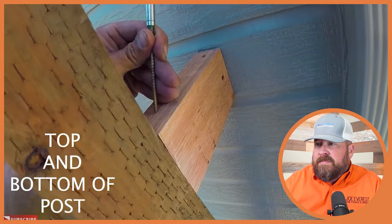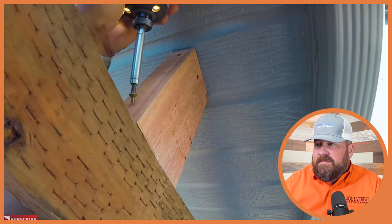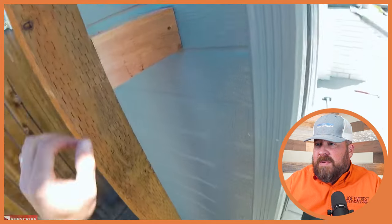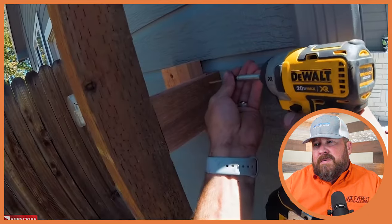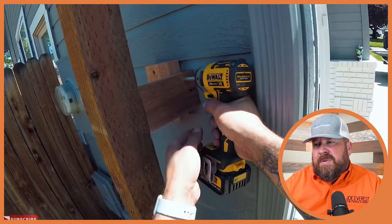Make sure you drive it right into the framing of the house and not just the sheet of plywood. For added support, he added another support piece behind the spacer block and ran some screws through it, mostly to limit the amount of sway. I'm not sure about that at all — if the block was directly into the stud of the house but there's a block next to it, either this house has massive studs or at least one of those isn't going to be attached to the stud. It could lead to long-term damage to the house.